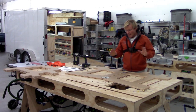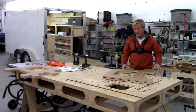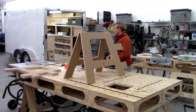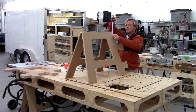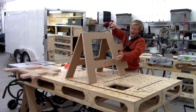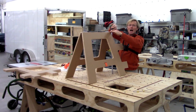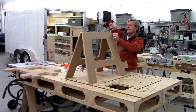For production purposes I'd set this one aside and do the other one, but for the video I'm just going to show you the one since the other is identical. I want the strap to come through these slots and go around the bottom, with the buckle in the middle — I've rounded over the edges so the strap won't get chafed over time. My benches are all set to 36 inches, so with the bench at 10 and a quarter, I want to be at 25 and 3 quarters. I'll make it a little bit taller than that because I know the strap will stretch and drop a little, and I can always fine tune it later. Since the sawhorses are at an angle, the outside corner is higher than the inside corner, so that's the side I want to measure to.